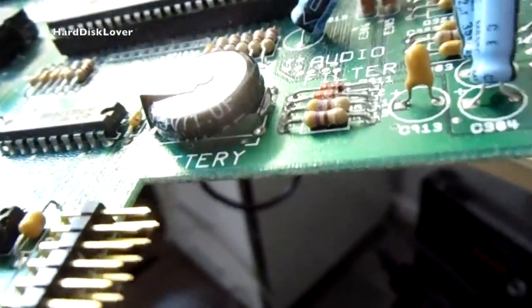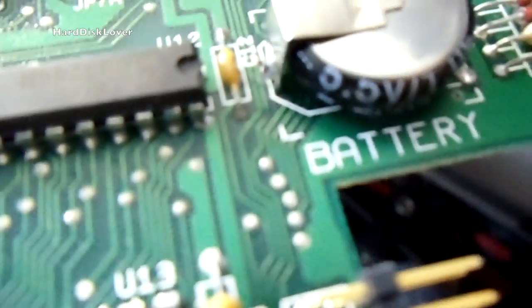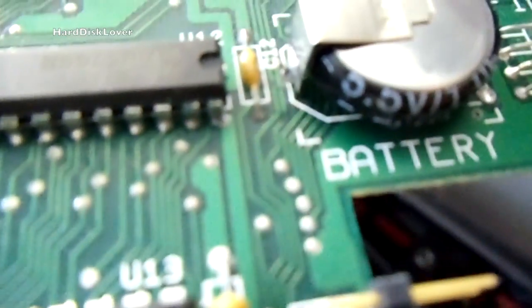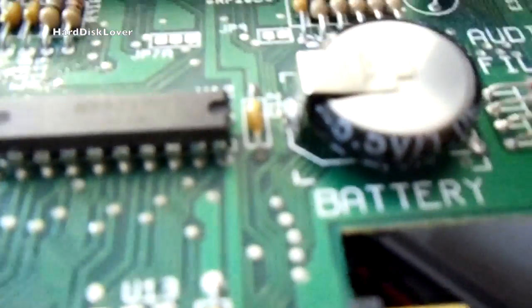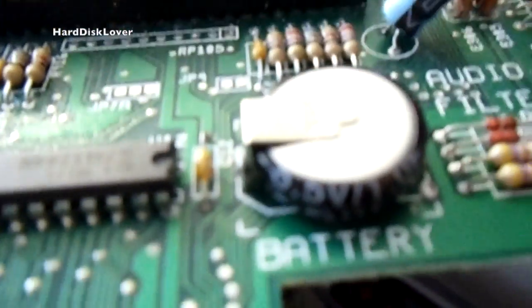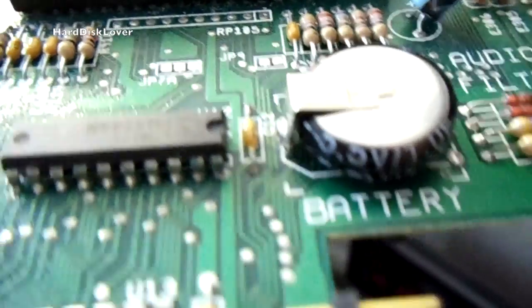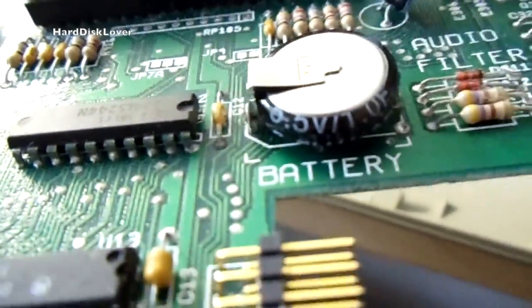And yeah, now I will have to test, of course, if the Amiga is fine, because if you look very closely down there, the contact of that capacitor here and 2 traces seem to be a little bit affected by the acid. But yeah, fixing that is also quite easy. In the worst case, I will just have to make new traces by just making the cables a lot longer on this. But everything else seems to be fine.